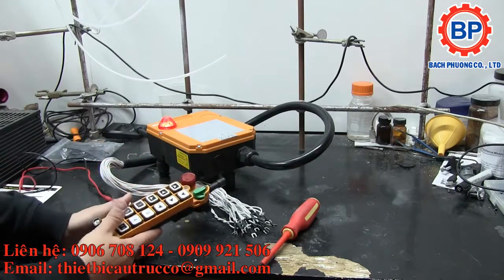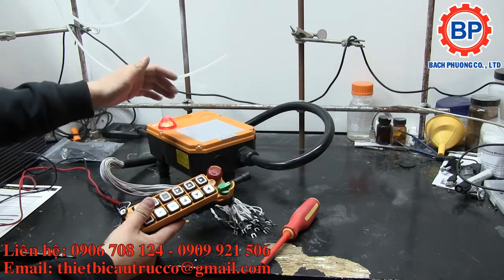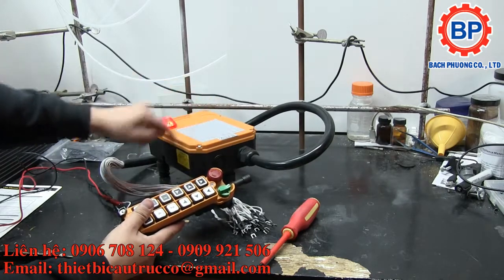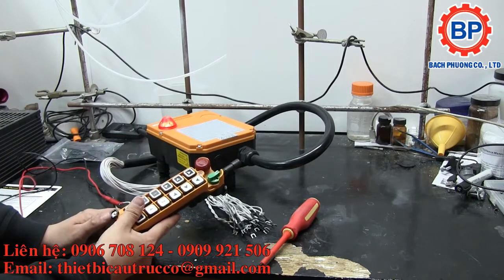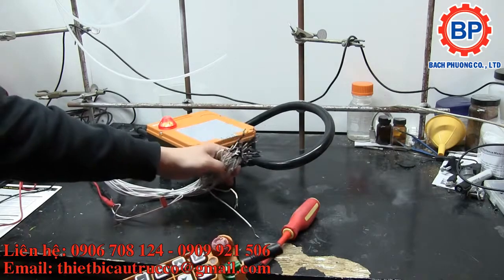From an integration standpoint, it's fairly easy to use. You give it either 18 to 65 volts AC or DC, or you've got a switch to tap internally to 65 through 440 volts, and then you can drop this in wherever you want, and you've got a whole bunch of dry contacts.